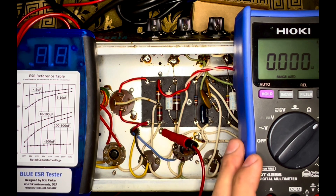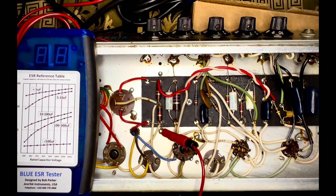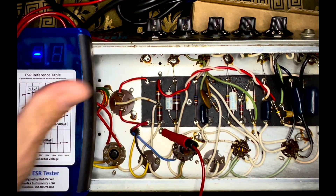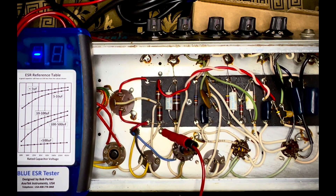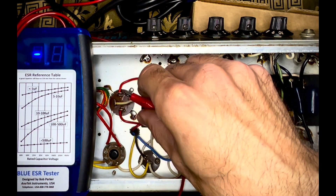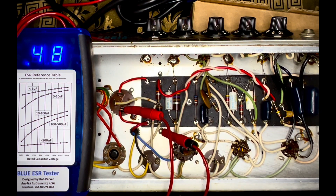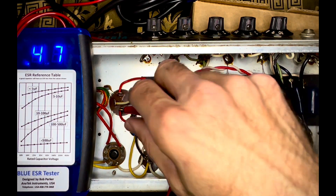So let's put this aside and let's focus on this ESR meter. I have one of the leads grounded. For a cap can rated with sections rated as they are, I'm expecting like one to two point something as a result. Let's start from the bottom. That doesn't look bad, right? And in most cases, if you saw a result like that and stopped there and didn't bother cross-checking with your meter, you might say hey, that's good to go. But it's not.